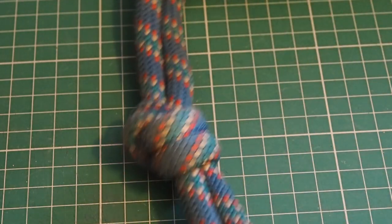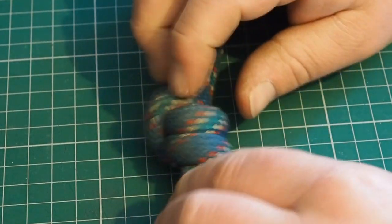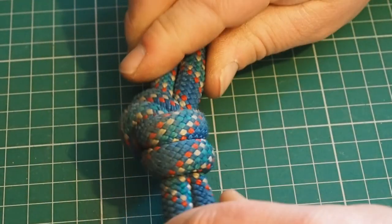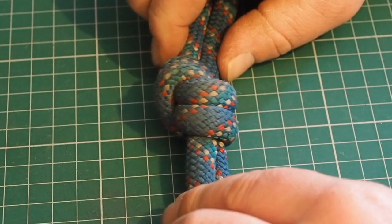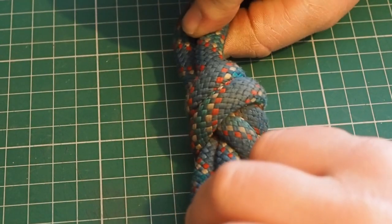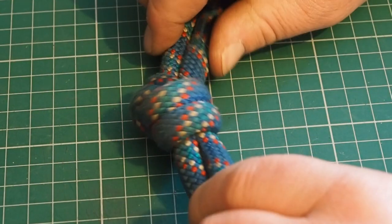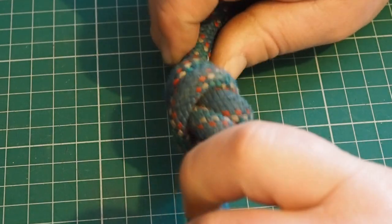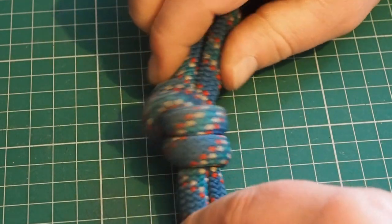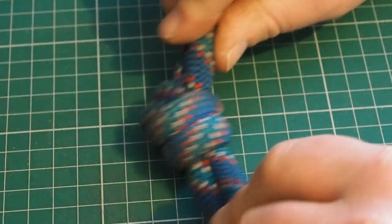One more to look at: here I've got an old set of my cow's tails. I've been hanging on these a lot while working, and when I came to inspect them I just couldn't get the knots undone — they're like absolute rock. There's no shock absorbency left because the knots can't tighten any further. More importantly for inspection, I can't see what's going on inside a seized knot — if I can't untie it, I can't check for grit or damage inside. That on its own is a reason to retire these cow's tails. It's definitely worth cracking your knots off periodically, untying, checking over and retying, because once it gets to this stage that's had it.